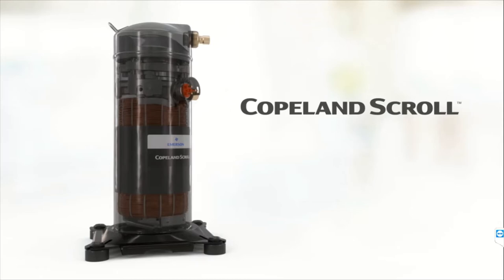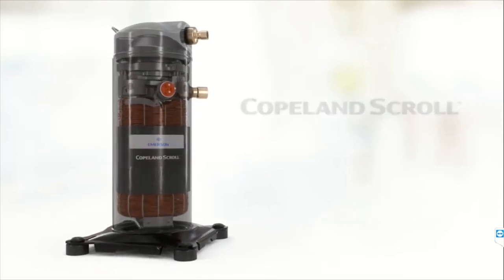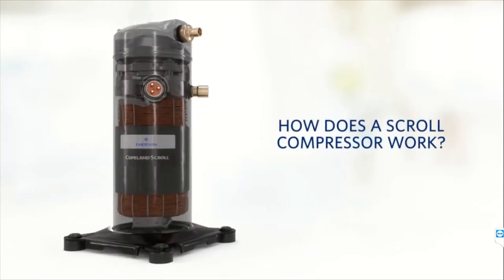These compressors are generally vertically installed. This is a new generation compressor. There is a base plate which is fixed in the foundation of the refrigerator or air conditioning system. In the middle of the unit, a rotating motor is installed which rotates the shaft of the compressor, and at the top of the unit there is a compression unit.